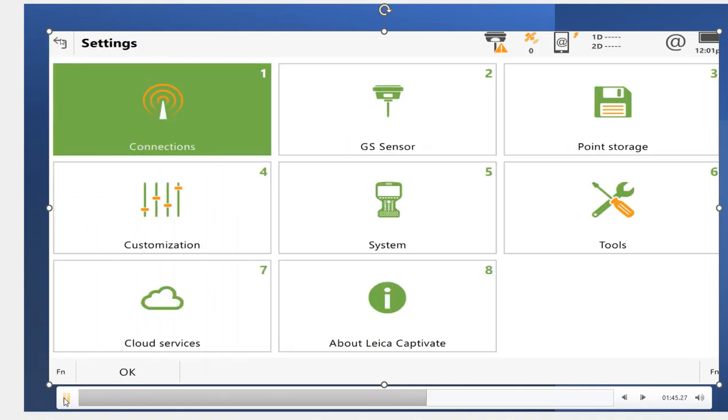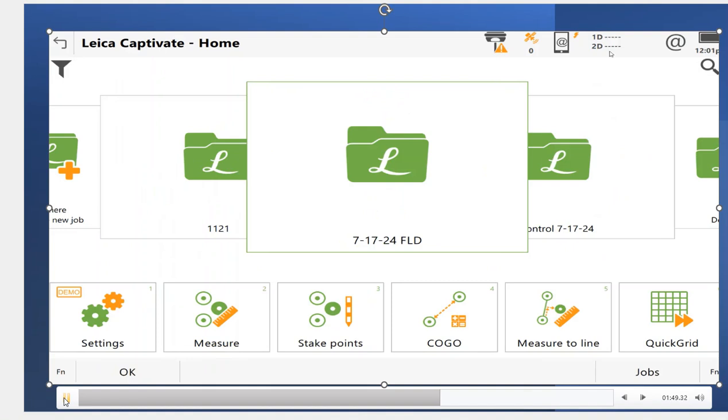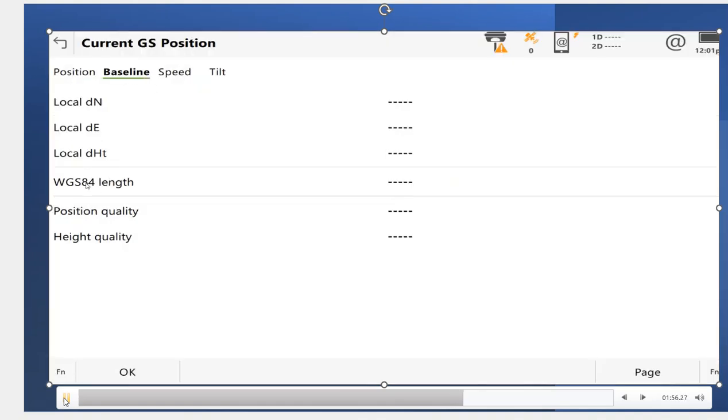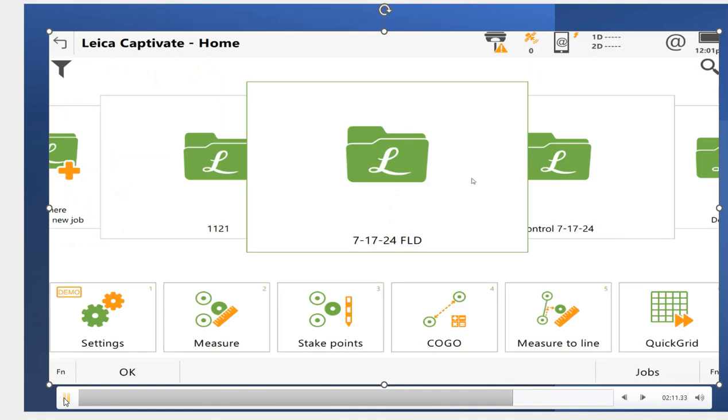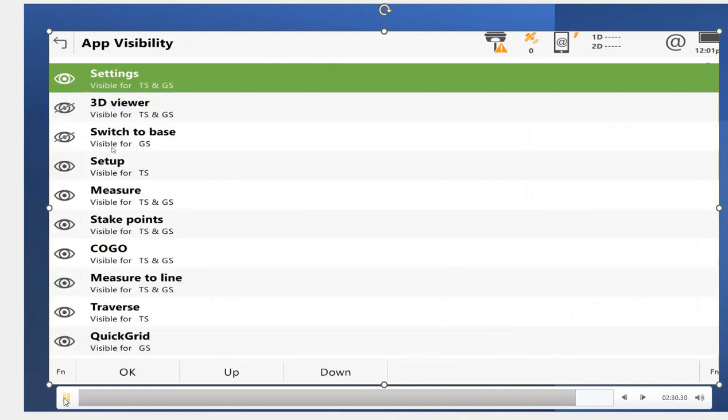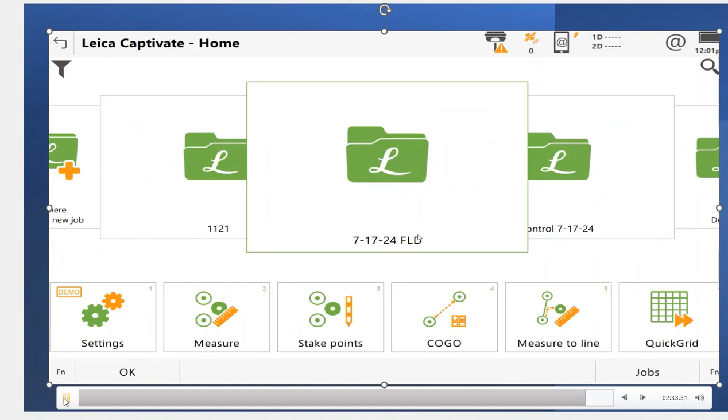Go back to the main screen. When working, we'll get on the internet. If you click on Current Position, Base Sign — this is just a tip — the WGS-84 length will show you how far you are from the base station. You want to keep that below 20 miles for accuracy; the closer you are to the base station, the better. I also want to show you how we can have mobile work styles. In my rover work style, I turned off the base set — I hit Settings, Customization, App Visibility, and I have a checkmark through 'Switch to Base' because I have a separate work style for my base station.